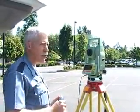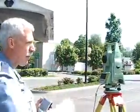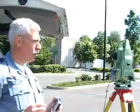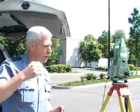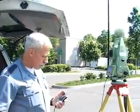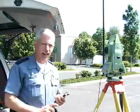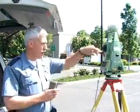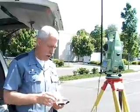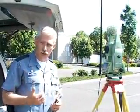We've now set it up so that the area between this unit and my backsight point is considered a 0-degree heading. Now, why is it important that we do this when we have a backsight set up? First off, if you recall just a few minutes ago, we laid a tape measure out to 50 feet from this point and put another PK nail in up the road. We do this for a couple of different reasons. The safety reasons, first off.